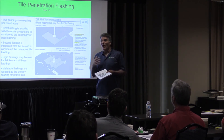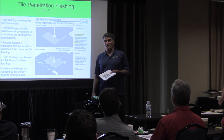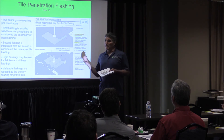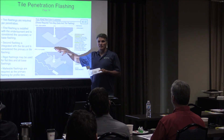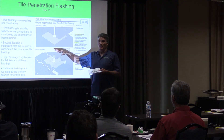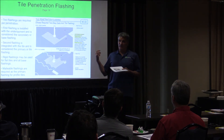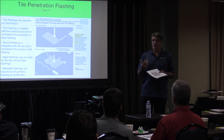You can still put on a good roof. I do inspections and repairs, and when we tell the homeowner your backup system is shot, some guys will say you have to re-roof now. The homeowner may not be ready — that may push them into an asphalt shingle roof. But if you can say, your backup system is shot, and if we deal with the primary system, we can milk out some time. You don't have a backup parachute anymore, but we can milk out some time. I can make money off that roof for a few years until they've saved up so they can afford to do it right. At that point I can upgrade them to a better tile with a color that's going to hang in there longer, maybe with a different type of batten that gives them some other advantages.